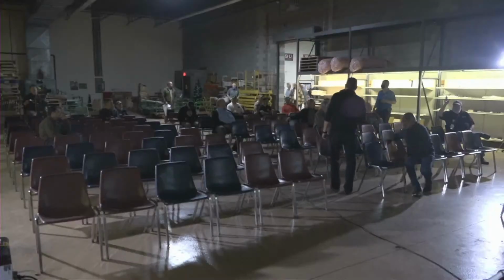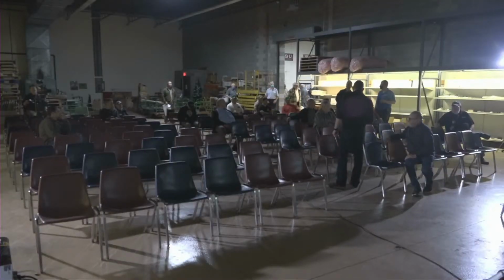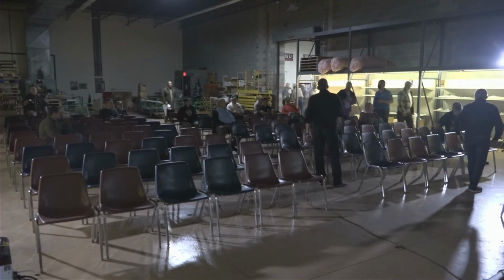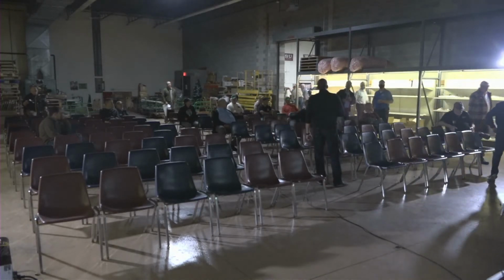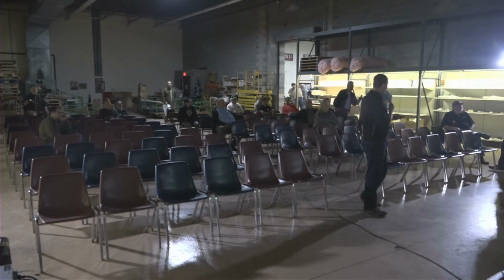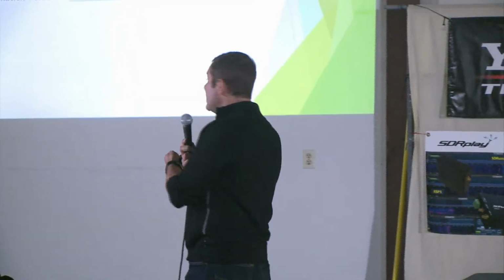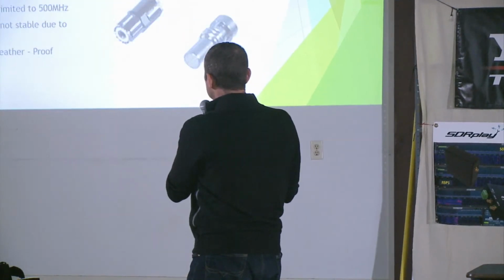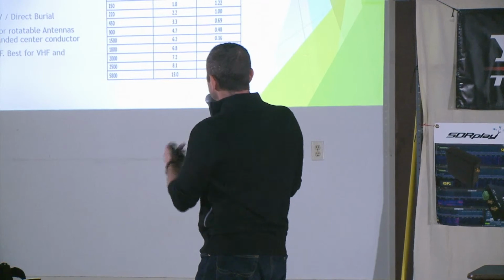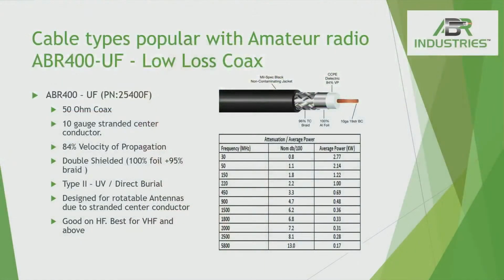Okay. A question I have is, and I don't really know one from the other, but HRO always has me buying 25400 FPL. What is that? Okay, sure. 25400 is that 400 or 8U size. That's the double shielded. I'll go back to that. So this is the 25400 flex. This, for the market, for HF, 2 meter, 440 up to 900 megahertz, is a great product.